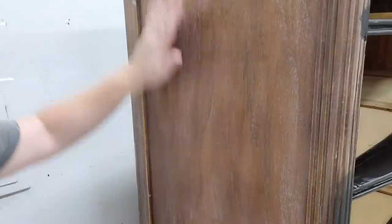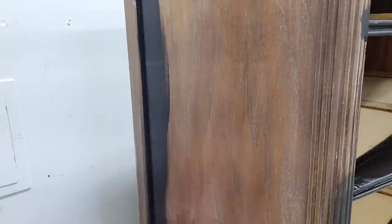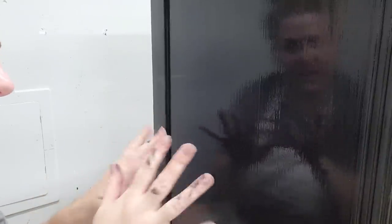For the side — one of those wide open spaces — I overfill my brush a little heavier on paint than normal, go all the way from top to bottom, work one small section, then slightly overlap and do the next section. I don't try to tackle the entire side at once; I work one small section at a time, get brush strokes nice and even, then move slightly over. Here's my first coat done — you can even see my reflection in it. Any light brush strokes will self-level as it dries.